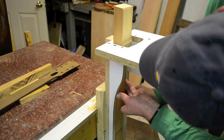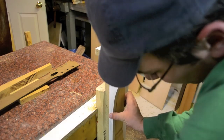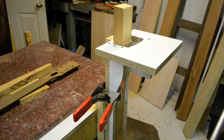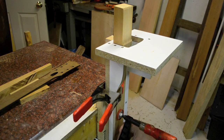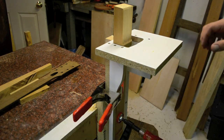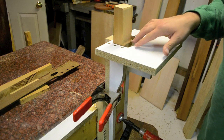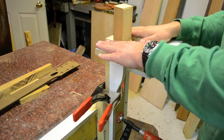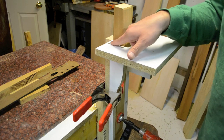I'll line it up here and make sure it looks good. First I'll get a clamp just to hold it down, then I'll take a bigger clamp and not only clamp it down to the board but clamp it down to the bench as well. Now I'm ready to cut — I've got it pretty fine on each side so that way I've got a perfect flat 90 degrees and can make the cut on each of the three sides.